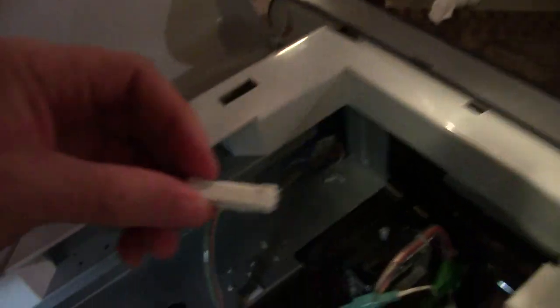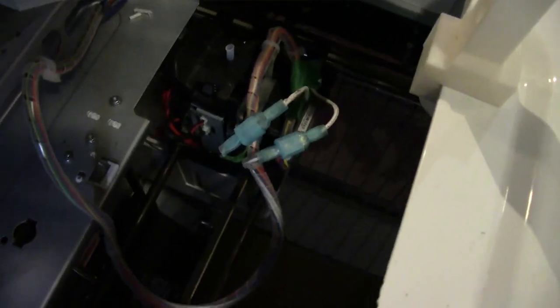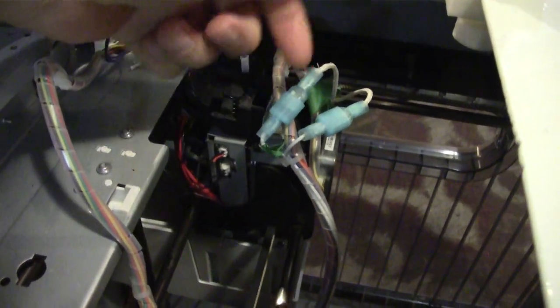What I did at first — I was suspecting my connector. This is the original connector connecting my heater for the extruder. I went online and saw some people experiencing the same kind of heater decoupling error, saying it might be because of a faulty or loose connection in the original connector. So I added a little bit of conductive grease, but it didn't help. I also tried another type of connection using quick-connect connectors, but that didn't work either.